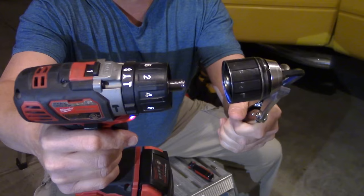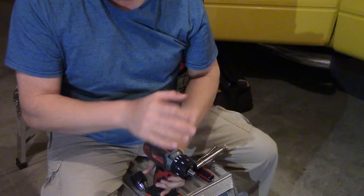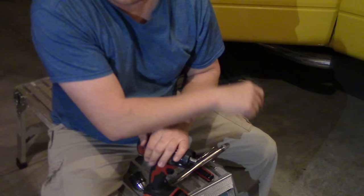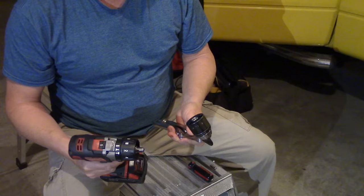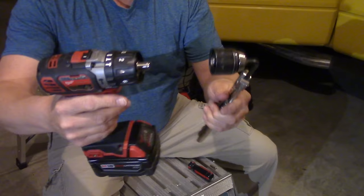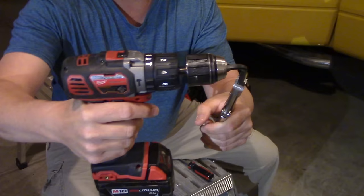Now a half-inch chuck — your standard mounting screw or stud, whatever you want to call it — is going to be a half by 20. Unfortunately, I've caught in some comments and other information on replacing this on Milwaukee drills, because I was looking for a good replacement chuck — and like I said, that good replacement chuck is in the description down below. Milwaukee on some of their new Fuel models has actually changed that thread size. That half by 20 is a very standard size for half-inch chucks. So if Milwaukee did do that... Milwaukee, you can suck it. Not been super impressed with this one, and if you're going to change that so I can't buy a different brand chuck, you suck.